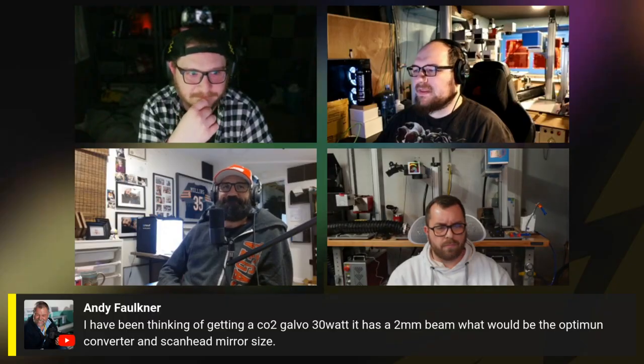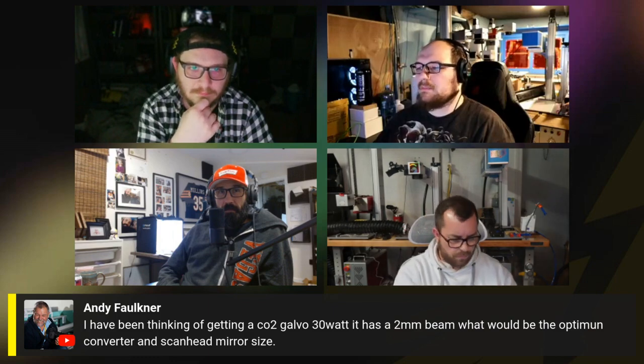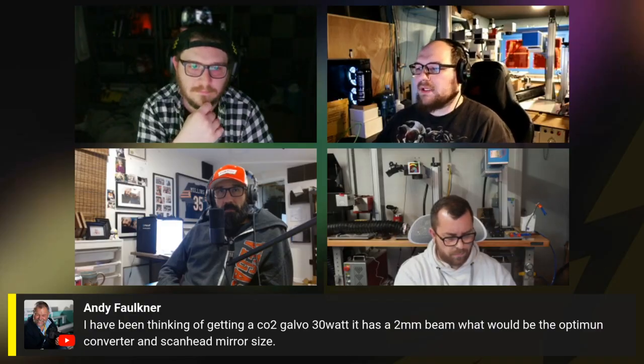Andy says, I've been thinking of getting a CO2 Galvo 30 watt. It has a 2mm beam. What would be the optimum converter and scan head mirror size? By converter, you probably mean expander. Typically a lot of the more budget ones come with a 10mm head, and therefore with a 2mm beam, you're probably going to have a 4x expander. If you wanted to reduce the dot at focus to get more detail, you can do that by getting a 20mm head, which increases the size of the mirrors in the head.